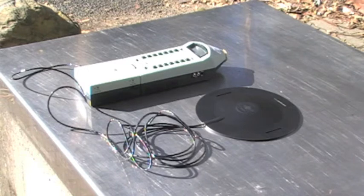To measure vibration we measure the acceleration of vibration. You should consult the module. We're using a Brüel & Kjær precision vibration meter which will measure weighted acceleration in all three axes: the X front to back, the Z up the long axis of the body, and the Y side to side.